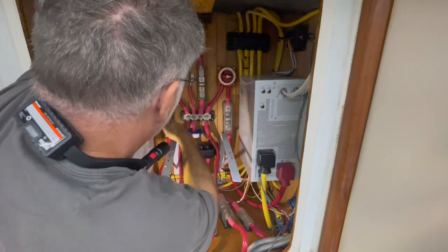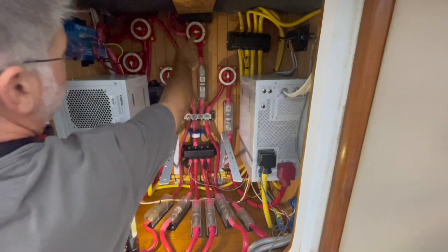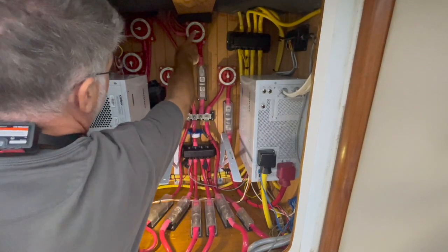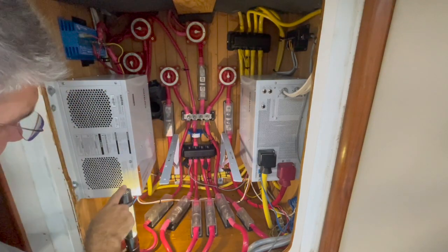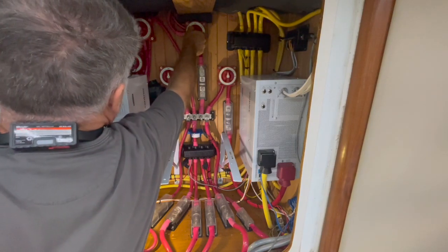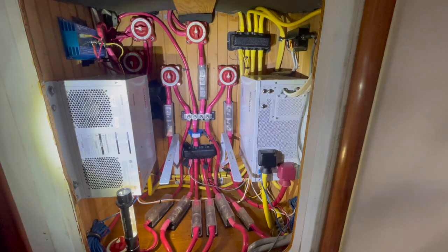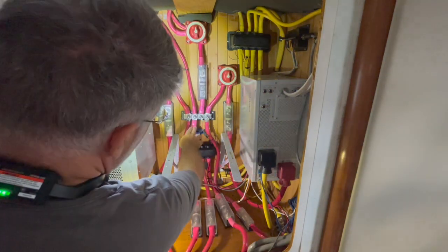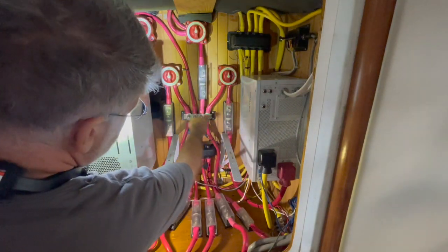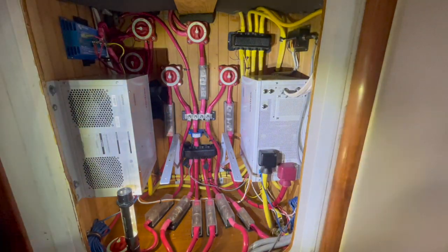Now I'm going to take the DC power away from them and they shut off, and now I'm going to shut off the DC power to the pilot house circuit breakers. That's going to kill the lights. I do have a little flashlight here, so hopefully we'll have enough light. We're now safe because, though the batteries are hooked up, there's no power being drawn from this bus bar, so I should be limited in the amount of sparks that could possibly happen.